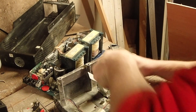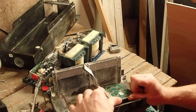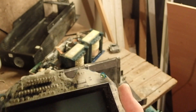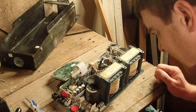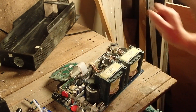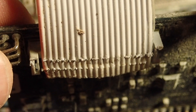Next thing I did was take up the LCD. You'll notice I cut the ribbon cable down to where it wasn't melted anymore, because I'm going to stick that back in the connector. But at that point it was too short to actually leave in the casing — I had to cut 50% of the length off it. This was dirty as well, so I took the toothbrush to it, just packed with dry chemical. Apparently the dry chemical is not particularly toxic — it will agitate your throat if you breathe too much of it in, but it's not overly toxic. I was trying to push the ribbon cable into the little claws that grab the wires. I think I got close, but this may have been a large part of my issue — I wasn't perfect at getting all the contacts made.